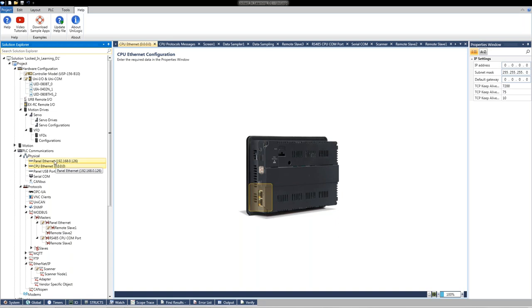Now, there are cases where, for example, Modbus is used over the network Ethernet. There are cases where people have wanted Modbus on a separate network than the network they use to download. So the IO and the other devices they're talking to were on a totally separate network than the network they use to talk to the PLCs.